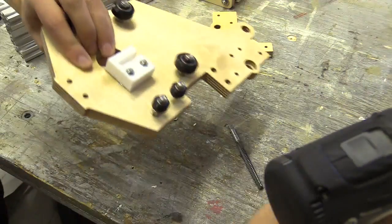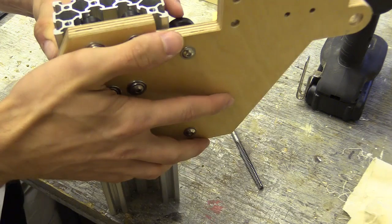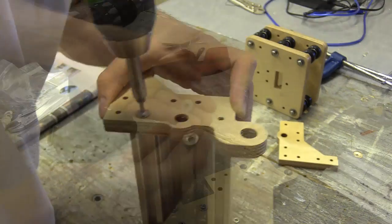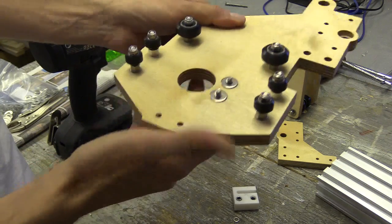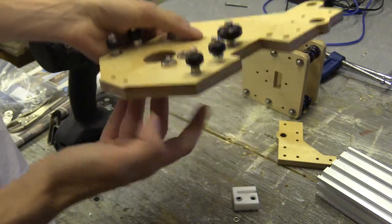To do this I'm going to place the wire plate onto a piece of c-beam and attach the end cap with its bearing in place. Just by looking through the bearing hole I can tell I need more washers. These are 2mm washers and the ones I've already added are 1mm, so that will create a few more millimetres of spacing.